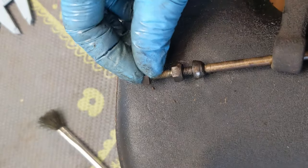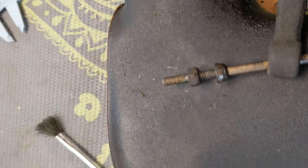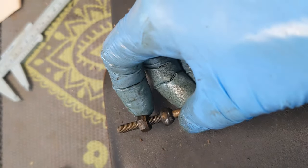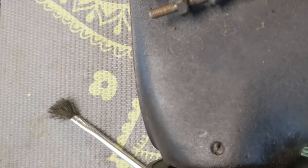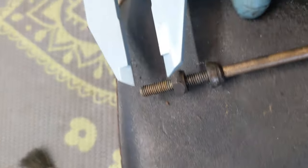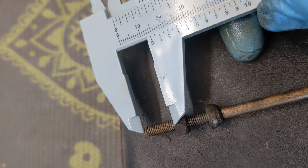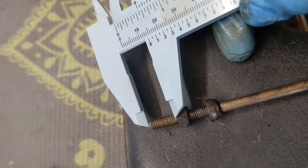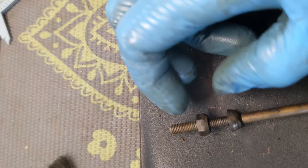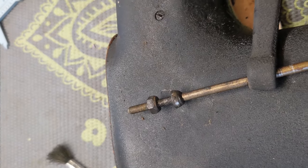Now I'm going to show you — there was a little nut, we've got a few nuts here. There's a nut up against a nut, and then there's another round one down there. I'm thinking that this is an adjustable area where you can raise it or lower it to adjust the knee lift. And just to keep track of it — to the top of the second nut, it looks like it is about 14 millimeters from the top of the screw thread to where this one is ending. Just so I can put it back together the same as it is right now.